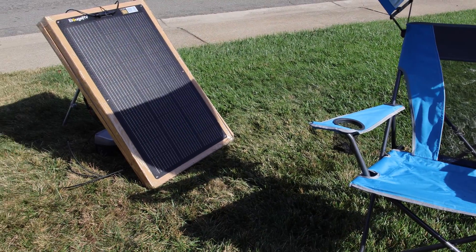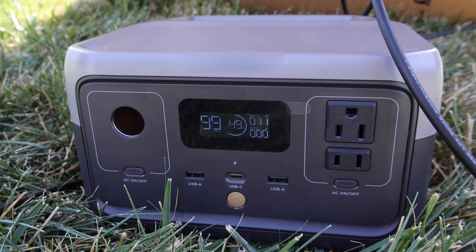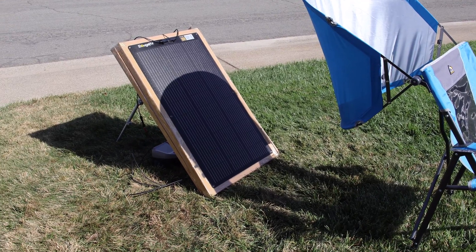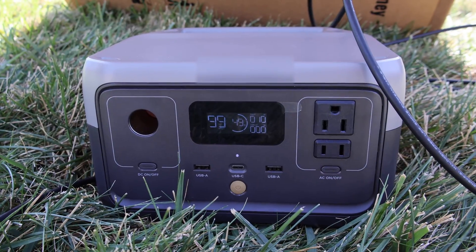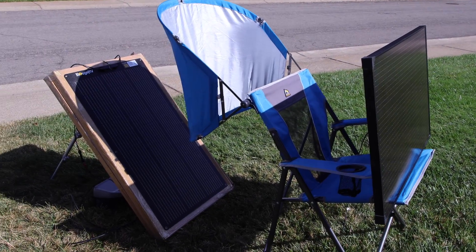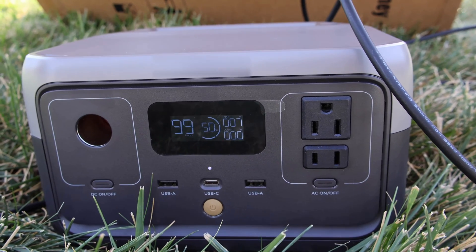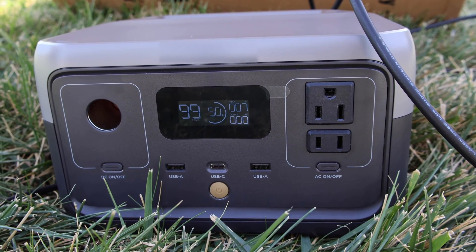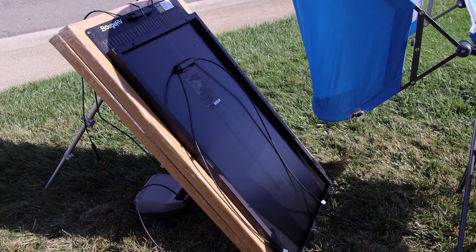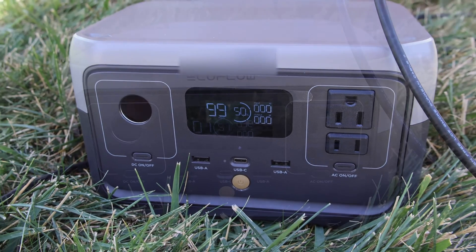Now with roughly half the panel shaded, this should probably go to zero — but we're still getting 11 watts. I like to do ambient lighting versus just putting a board across it. With a board across it, it would be zero, but with ambient light I still get 10 watts. With fully shaded it should bring us to zero — actually seven watts still. That's pretty good for a flexible panel. Fully shaded and blocked off — and there we are at zero. Overall it did very well in the shade test.